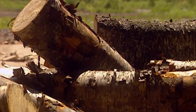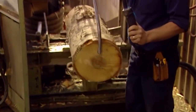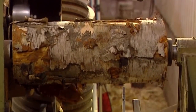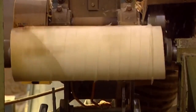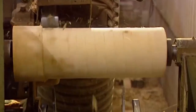These hefty wooden logs are lifted by grippers into a debarker. Most toothpick manufacturers tend to steam the birch logs first, which makes it easier to cut and taper them. Since the bark is not required in fabrication, it is removed by the machine. The debarker operates in two passes — the log is transformed into a smooth, barkless cylinder. This makes it easier to mill and work with. However, even though the bark is not needed, it is still not discarded. Instead, it is sold to a neighboring factory where it will be used as fuel.